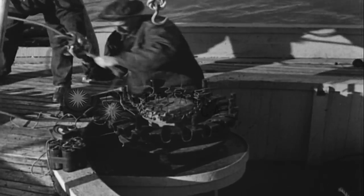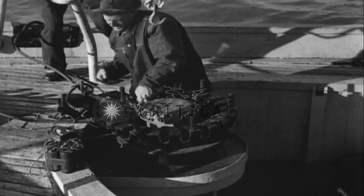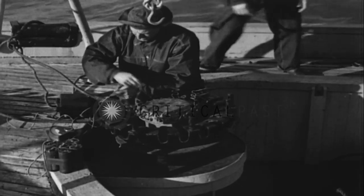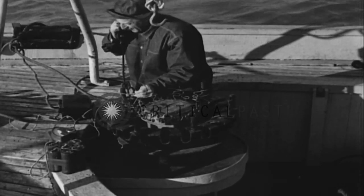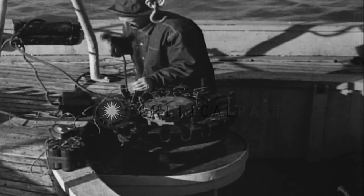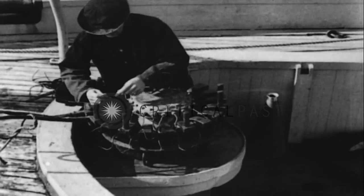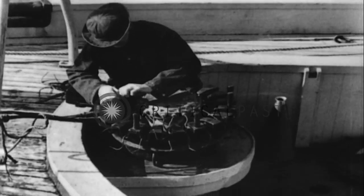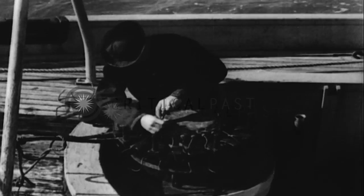After the mine has been dropped, the Turk's head on the cable is hooked into its proper slot in the distribution box. The telephone is connected to the shore cable and the casemate notified that number 10 has been planted. The cable is joined to the distribution box with a watertight joint made in the same manner as the one on the junction box. Conductors are bared and joined. Rubber cement is then added. Two layers of rubber tape are wrapped around the joint.